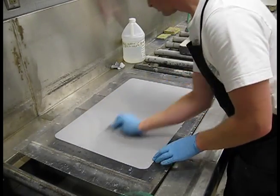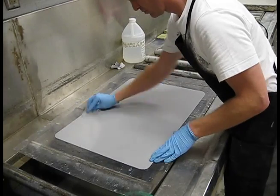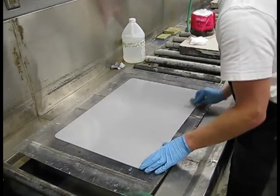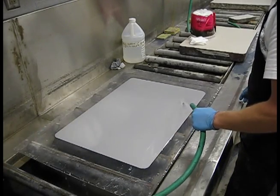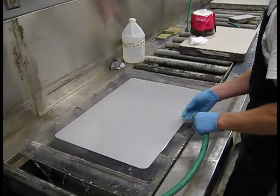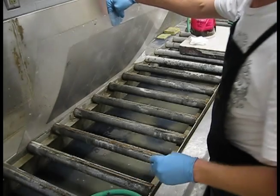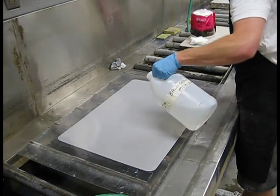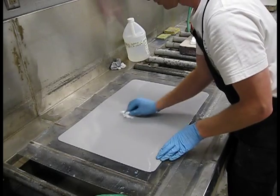There are different ways to counter-etch plates. You could do it with just hot water — the hot water feeds energy into the oxidation bonds and the dirt on the plate, giving them just enough energy to release. But hot water doesn't always break those bonds sufficiently. Another counter-etch solution is made with diluted citric acid, which is pretty good for aluminum plates. In our case, we're going to use a stronger solution because you're beginners and I want to make sure you get your plates very clean.